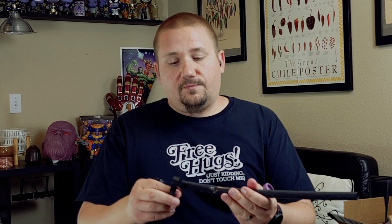These little figure eights, and actually this cap here, a twist-off cap, are pressure attachments for the supply line. For the figure eight, that's actually a cap too. What you do is at the end of your run, if you put one loop over and then bend this, that'll actually cap off your supply line.